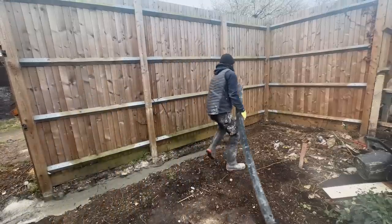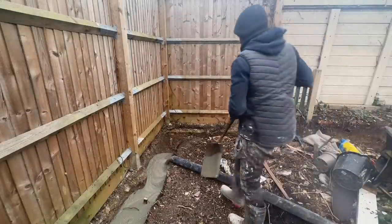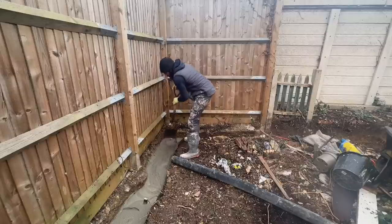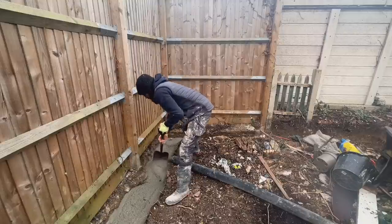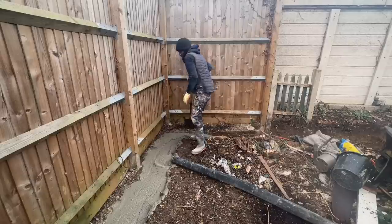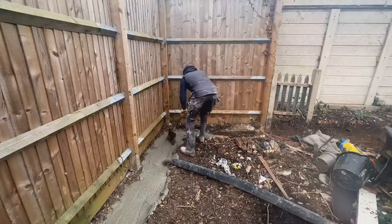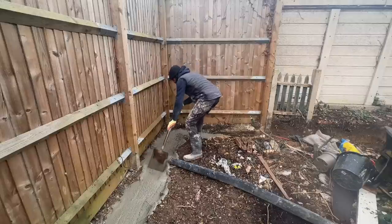We're using a pump today. It's just me and the driver basically - he's down the front of the house doing all the controls, sending me the pump in batches of about half a cubic meter, then we reposition and check our levels and keep moving. I told them I needed about 2.5 cubic meters as my estimate. When you book these services, you pay for the amount that you estimate, and if you're over at the end of the job they will invoice you for the balance, or if you're under you can get a refund.